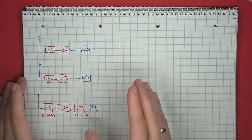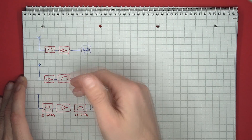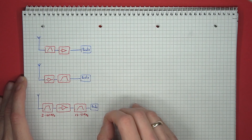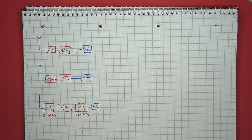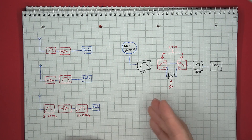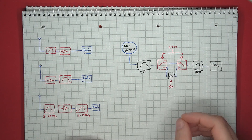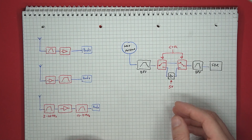I tried out multiple setups for this experiment, with the final one being the most successful. The main thing I changed was the exact position of the amplifier relative to the various filters. I tried filter first then amplifier, and amplifier first then filter, but the best result was a dual filter setup — both before and after the amplifier. I guess this way you stabilize the antenna impedance a bit and also eliminate all sorts of unwanted signals. I am inserting and removing the amplifier using relay switches, so we have a direct comparison.